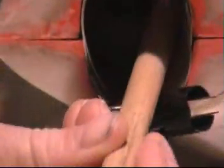You can do this with probably a small roller, which is the best tool to use for this. This is done while all the fiberglass is wet. No hanging around waiting for the epoxy to kick. All wet, and it makes a very strong fuselage.